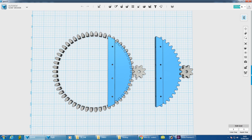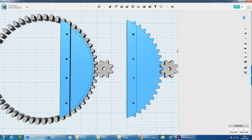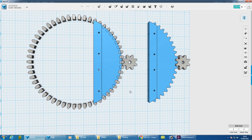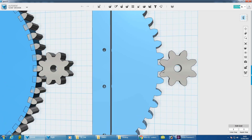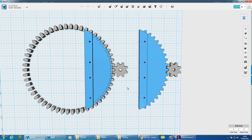I decided to make the gear manually, which I've done quite a few times before. What I actually did was get one of these gears, cut the teeth off, and then used the circular pattern tool to plot them all around, deleted the ones I don't need. I've got 54 teeth in this circle, and if I find the pitch is wrong I can add a 55th or take one away — that's pretty much all the fine tuning I can do. I think that looks just about right, and we can test it by trial and error.